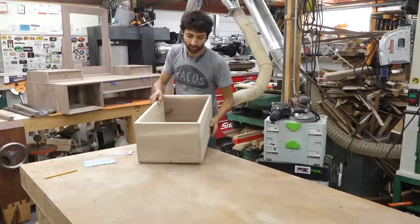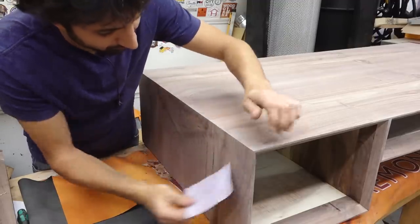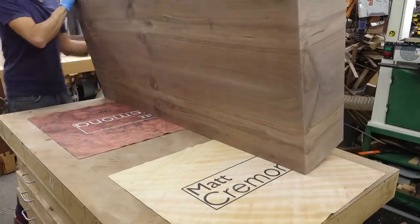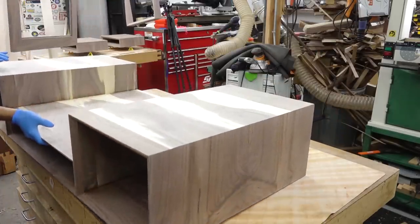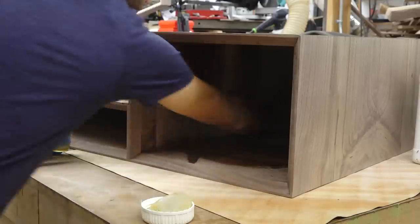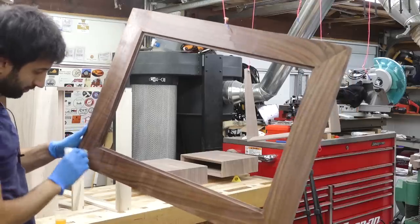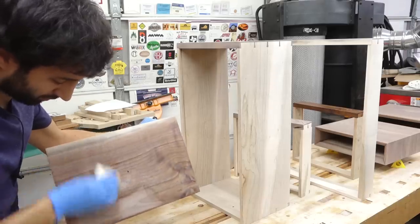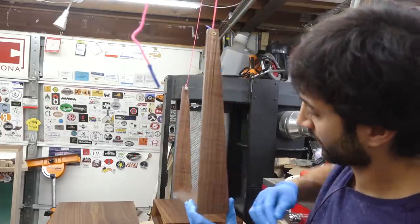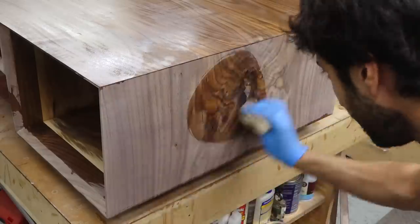I've been pretty good about doing my finish prepping as I go on this project, so there's only a little bit of detail work and finishing to do. I'll wipe on a bit of mineral spirits to make sure I didn't miss anything before proceeding with applying the finish. As is common with me, I'm using a wipe-on varnish. Since this dressing vanity is going to be used as an actual dressing vanity, I want a decent amount of protection — it needs to be able to withstand things like makeup, nail polish, and that lovely stuff that removes nail polish. I applied five coats over the course of a couple days, giving everything a light sanding between coats. The fifth coat goes on super light so it tacks quickly, which greatly reduces the amount of dust that can settle in the finish. A few days later, I gave everything a very light sanding with some thousand-grit sandpaper to remove any nibs I could feel.